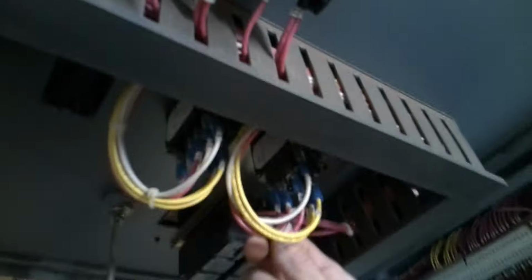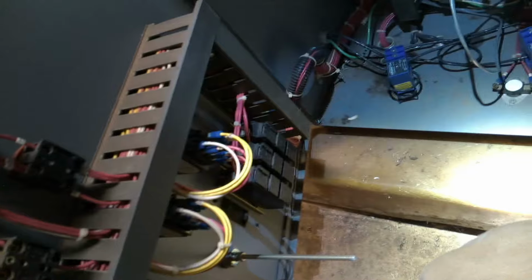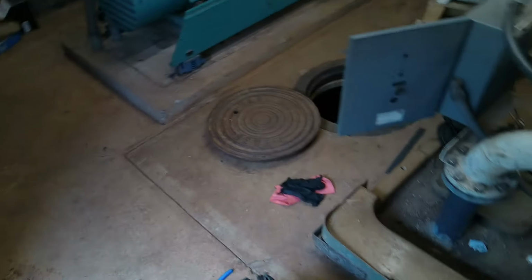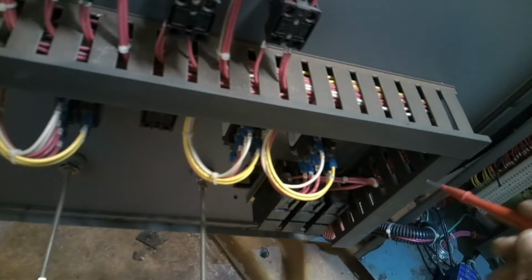Yep. So the way this switch works, when you energize it, it's essentially a relay that's powered as well. So you can manually operate the relay, or you can use voltage. And then you've got 9. Let's check a state on these contacts here. So this is like a relay with a handle. You can operate the relay with voltage, and you can operate it by hand.